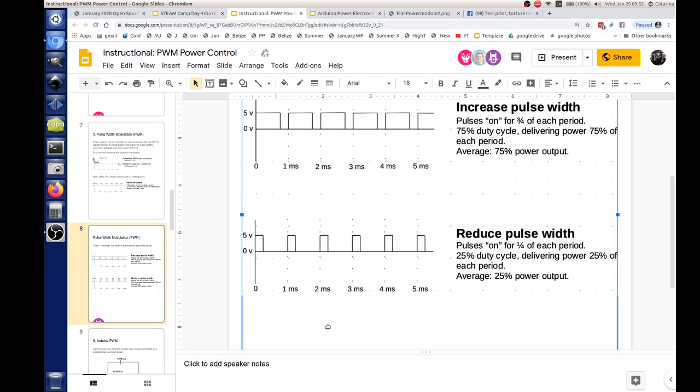But the capacitors themselves sort of help buffer against that? Yeah, they'll help, but when I talk about the power dissipation, I mean in the transistor itself that's doing the switching. When it goes to, say, switch on, it goes from zero power transferring all the way to max power. When it's at the max, the component is not dissipating much power. But when it's in between, there's a power differential, because that voltage has to go somewhere.